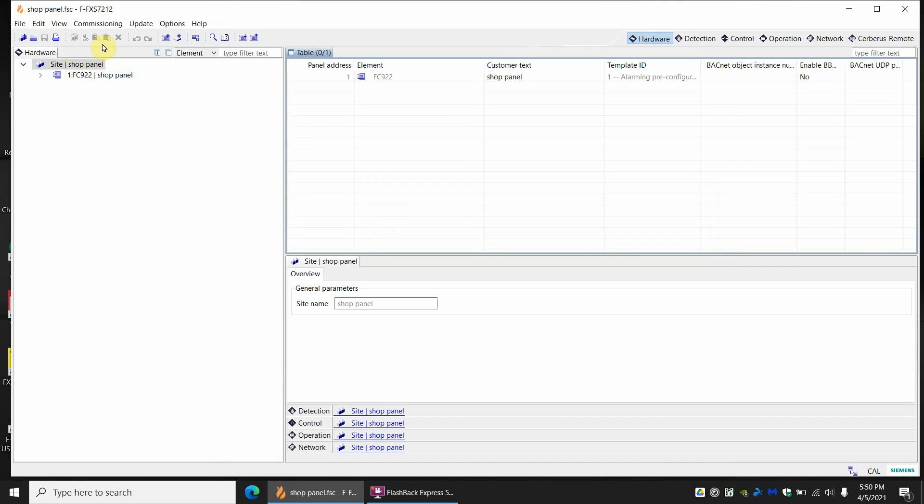The next step is actually sending the firmware update to the panel. First we're going to initiate the panel update at the panel itself. Open up the door and press and hold both the Acknowledge and the red S32 button that is right on the inside of the PMI. Press and hold both at the same time for about five seconds. After about five seconds you should hear a little beep, then the panel is going to start a reboot process. Depending on what current version of firmware is on the panel, it may show a couple different screens, but either way it's going to boot up in firmware mode.